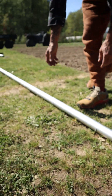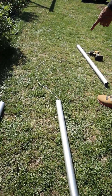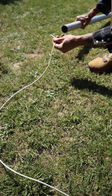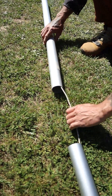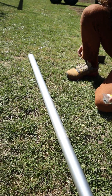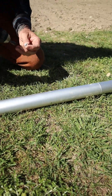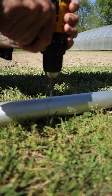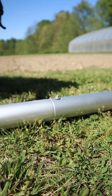So this is me feeding this wire through as I attach the sections of this sectional pole. As I attach each section, I just feed more wire through. I've already done five of the eight pole sections. Now I'm going to assemble the sixth one. As you can see, I've already fed the wire through and I'll just feed it through this section and continue that process all the way down until you get to the bottom. Tighten those together and then just using these self-tapping metal screws and putting a couple in each section to hold them secure — at least two per section, maybe three.